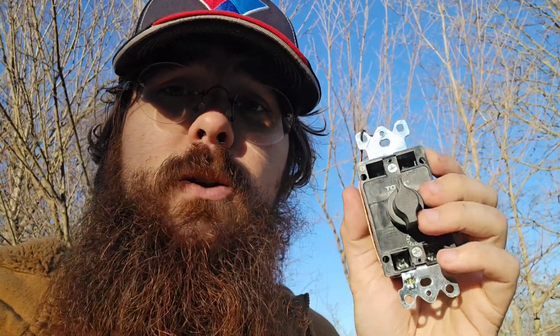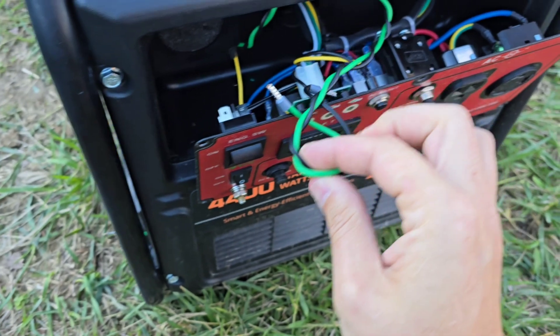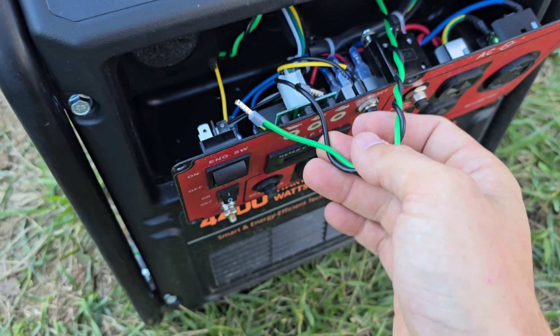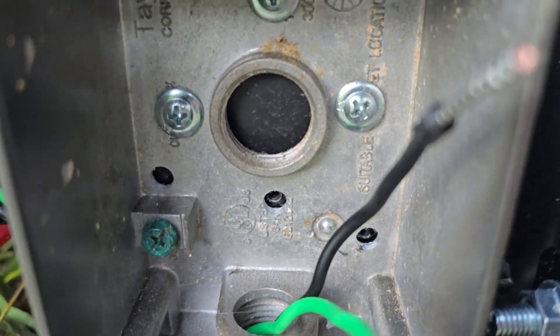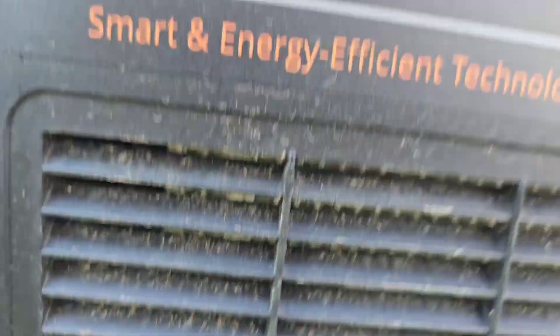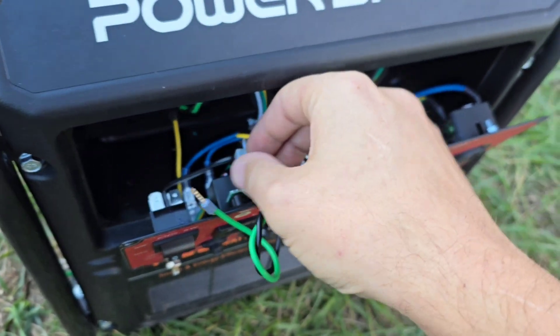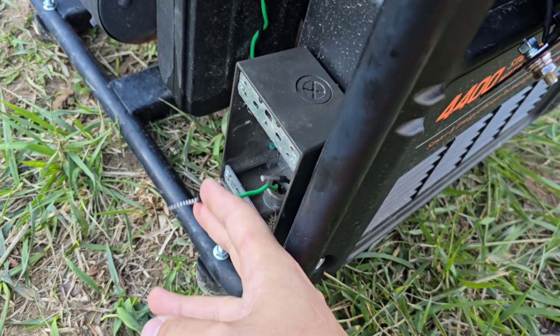Also important is that this is spring-wound — there's a spring inside, you wind it up and it ticks like an old-fashioned clock. It doesn't need any power to work, it just works. We've got a pair of wires here, green and black — black going to the coil and green going to ground — feeding through a little hole that was already in the back of the panel down to an outlet box I've screwed to the side of the plastic converter box. I couldn't find any butt connectors, but since this is stranded wire, to go into the timer box we have to use ferrules.